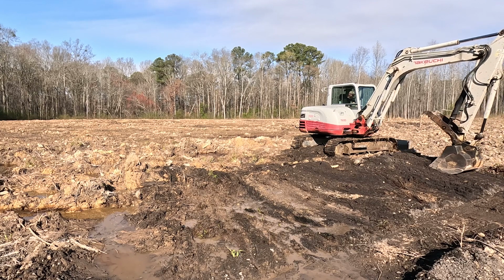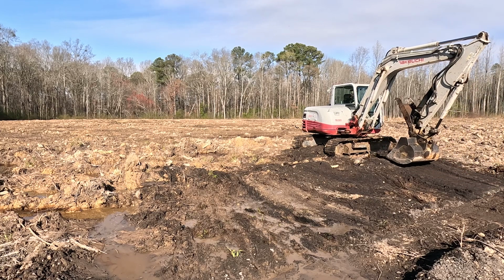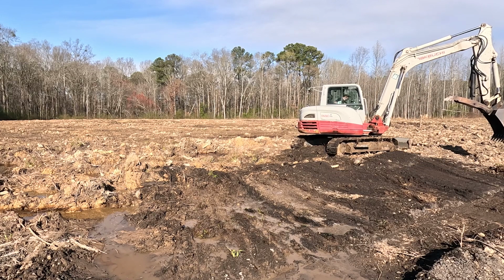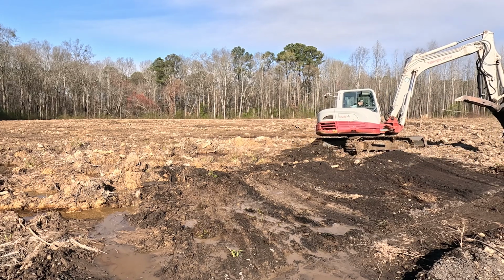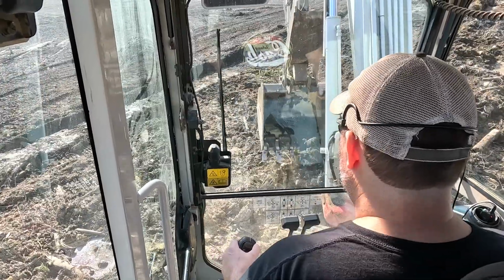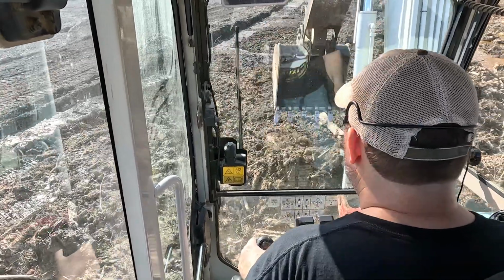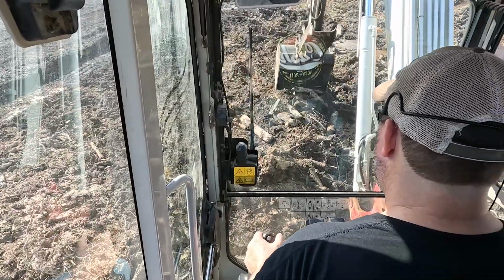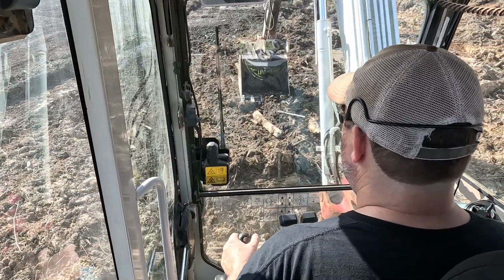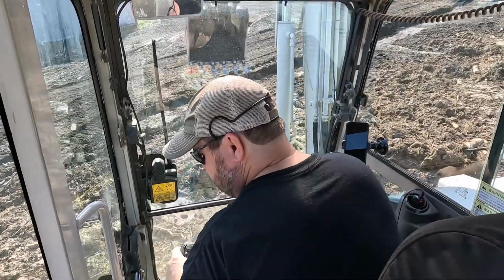A lot of reach from where I'm at right this second, but in the next go around we'll be able to kind of position a little bit better. It is just really, really nasty. If I can just get sort of a rough grade established, just following the existing slope of the land, I can slick it off of the blade, probably. Just kind of depends on how marshy it is. But I would just like to get it where the water doesn't puddle as much up here, and we'll just go ahead and drain out. I think we can get that done. Just gonna take a little work.